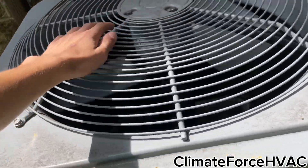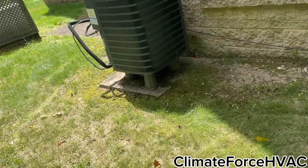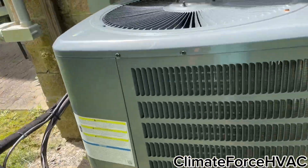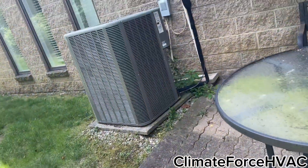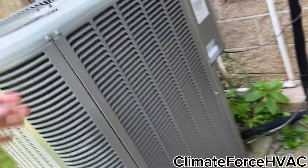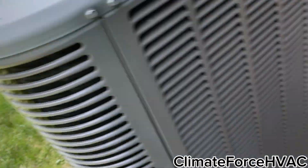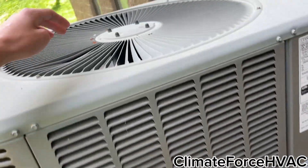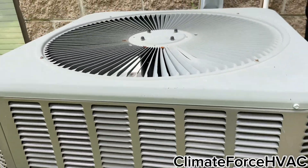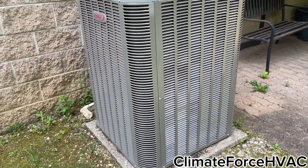That is some really hot air. Goodman. And a Lennox — nice. This is the heat pump's first ever defrost cycle. Oh, that's going cold. The compressor's not running. That fan looks like it's spinning slower too. It's a weak capacitor.